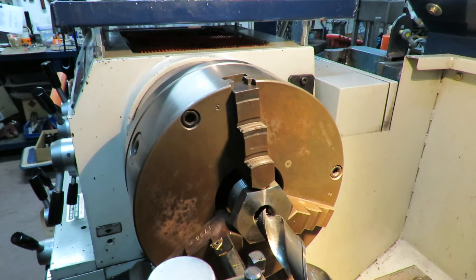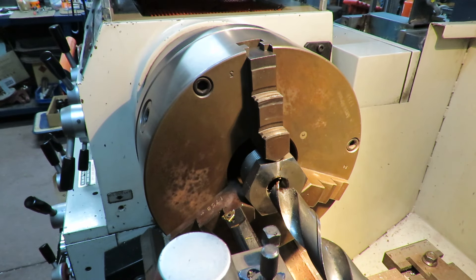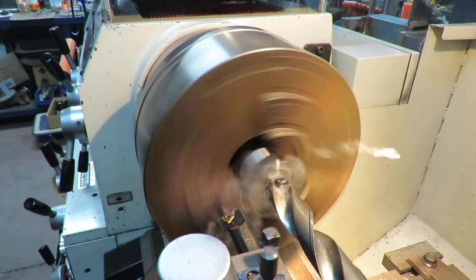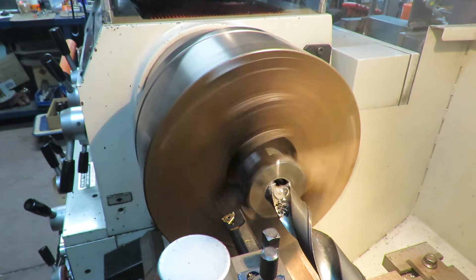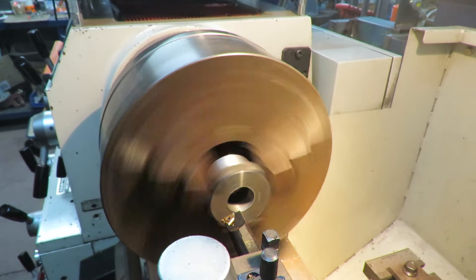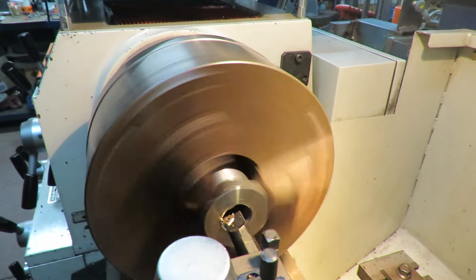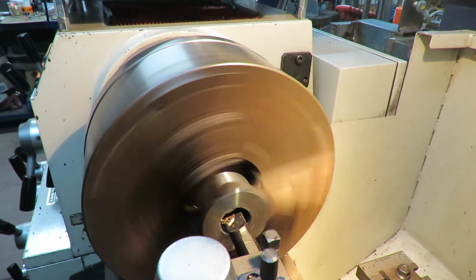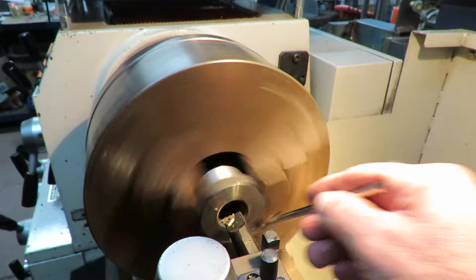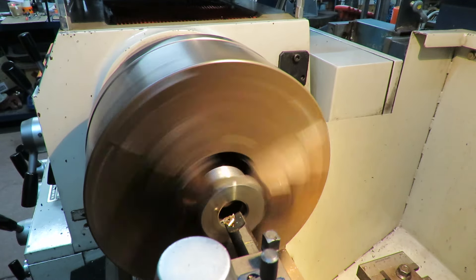Yep, that's all right — maybe we'll give it a little bit more down. There we go, a bit of black gooey stuff. We're now going to go in and provide a bit of a start. I already know on the DRO what that bore is, and I'm not concerned it was a little bit rough because the threading will cut it out. Now I'll set the depth for the first cut.